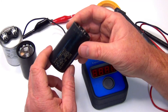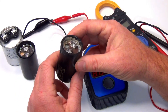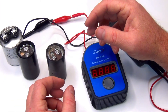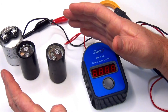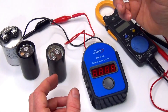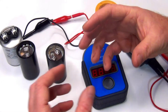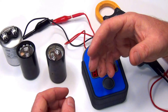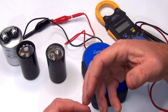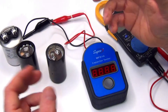A lot of times you'll phone these places and say 'Hey, I have this pump,' and they have no idea what capacitor it is, because it really doesn't follow from the pump name on the front. There are two separate parties that put it together in manufacturing — you've got the company that builds the motor and then the plastic wet head where the water flows through. So basically it's two different companies. The motors just go to say Hayward or Pentair or whoever, and then they take the plastic piece and assemble everything.